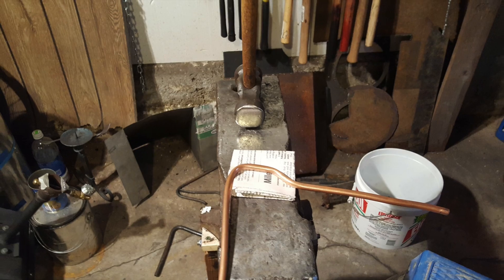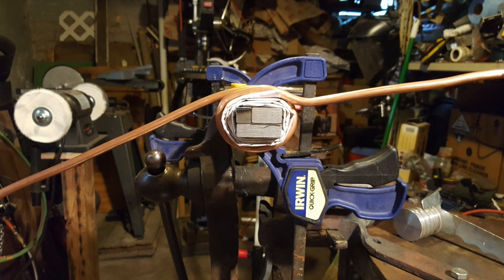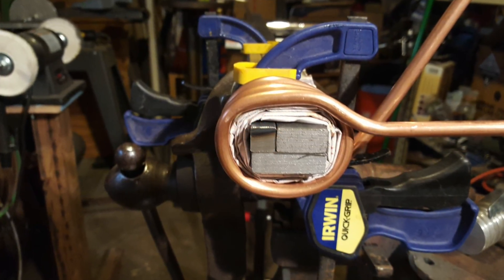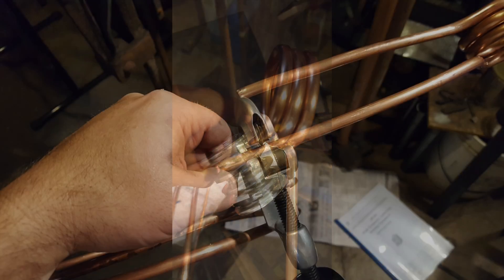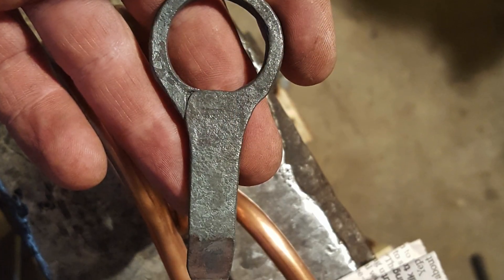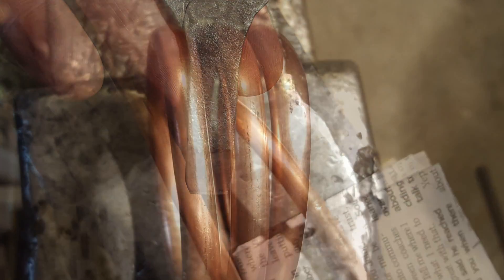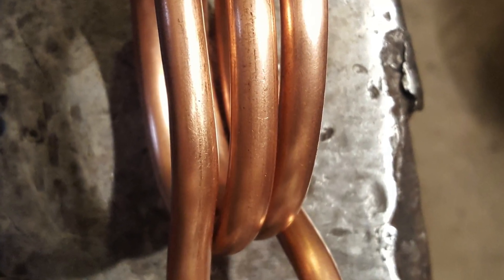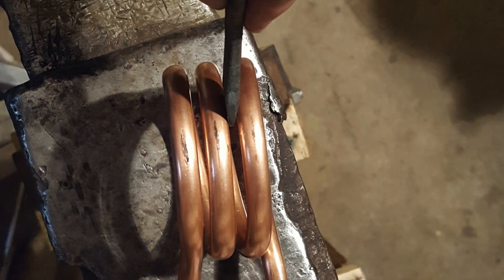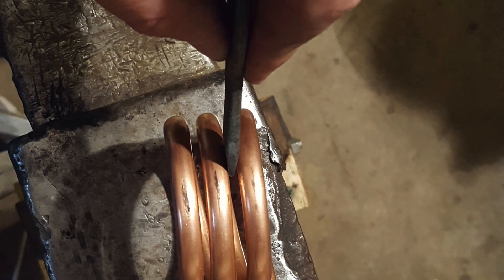I took it to the anvil to lightly hammer it out. After that, I wrapped the rest without so much effort to get tight corners. Overall that was adequate, but it did lead to a slightly sloppy coil. I only bent the last curve 45 degrees to match the other end and then used the tubing bender to establish the exit. After severing the work from the spool, I used a musket tool that I forged in a class with Jim Hoffman to spread the coils. Touching coils will short-circuit your loops, so fixing this is a must. A hand-forged tool suited the irony of using such a modern way to heat iron for an ancient craft.